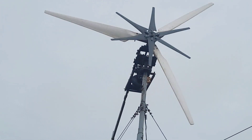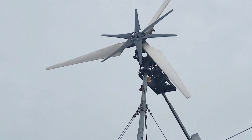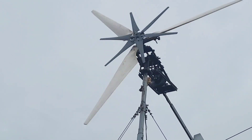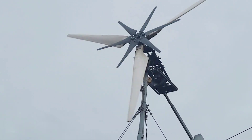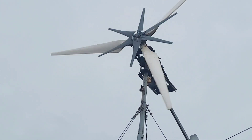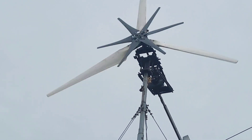It's supposed to be getting up to about 19 miles. What I've done is added another car battery so it's running at 24 volts, but the problem is one of the batteries isn't much good — it seems to let the volts in with no amps. I'm going to be uploading some videos tomorrow of how it runs when it gets really windy, but I'm just going to have a look at the meter now to see what it's saying. That'll be just about making 24 volts now.